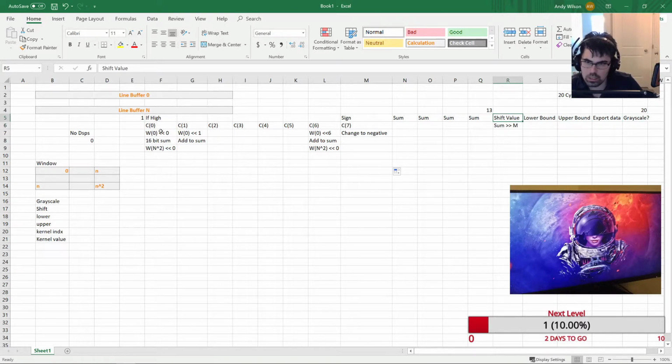So the hardest thing is going to be getting this parameterizable, especially for the line buffers and the window, which is just 3 shift registers. They're shifting, so how is it shifting? I think we had it. Yeah, the newest value comes here and they shift this direction. All 9 values are used for the shifting thing, so we would have to store them and pass them along, which sounds interesting, to pipeline that completely. But I think we can do it.